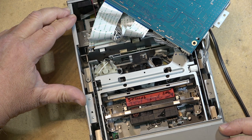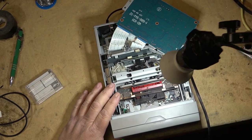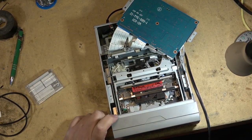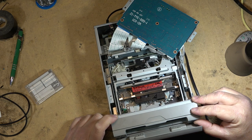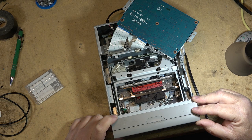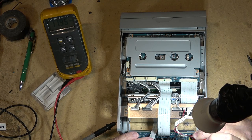It won't eject either. The way this thing is behaving, it's almost like a power problem. I've just pulled the back off on the bottom so I can measure the voltage — and the voltage is jumping around. I'm curious whether the AC adapter is at fault. The voltage goes up and then drops down as it tries to start up, so we may have a power supply problem.